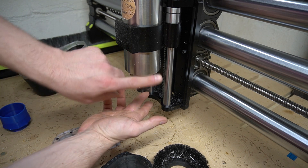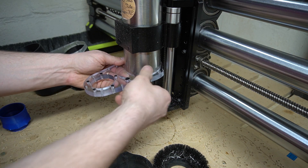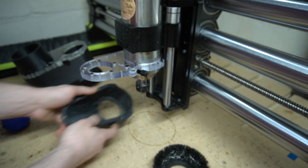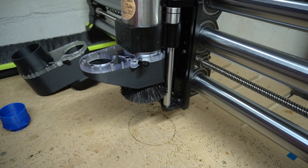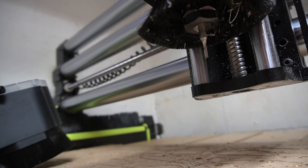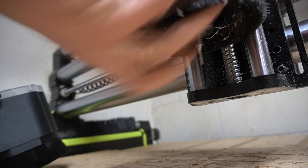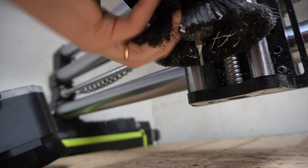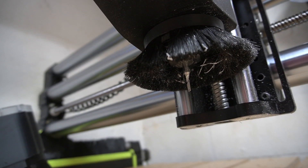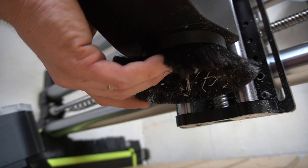It really is based on how far your collet nut is from the actual 80 millimeter part of your spindle. So what I do is mount this up here, put the brush rings on — and what you're going for is that collet nut to just stick down past that hard plastic brush ring about a sixteenth of an inch. See, that works — you're just trying to get this to stick down about a sixteenth of an inch, right there.